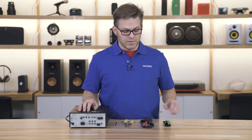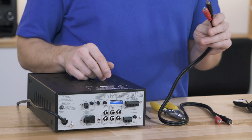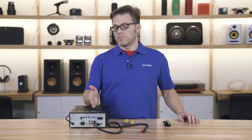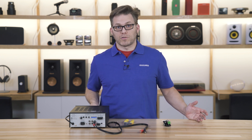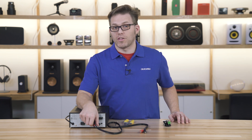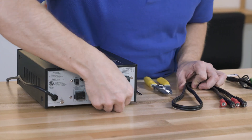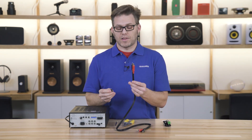If you've got a stereo RCA source going into your commercial audio equipment, I would say start with using your RCA connections first, even if that means not starting with input one but starting with input two or three, and just making note on the front of the amplifier what input channel you're using for your source. If all of those are filled up and all you have left is your Phoenix connector blocks, we're going to need to know how to adapt these cables to this.